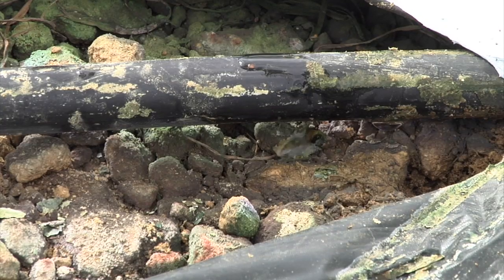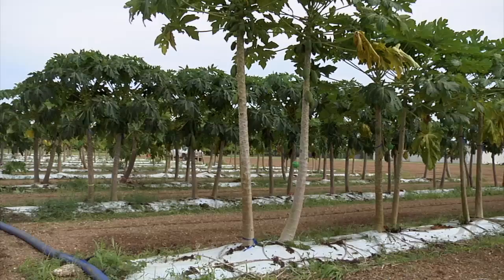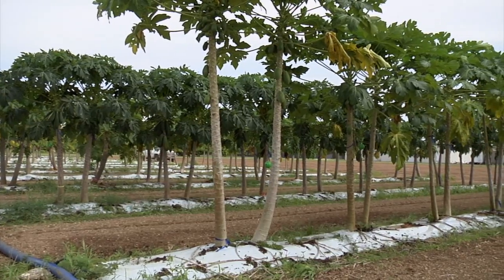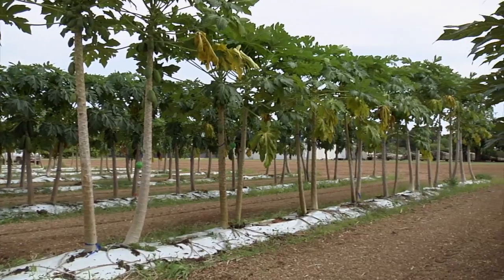It takes some time to fill drip systems when irrigation begins. The actual time of irrigation is not the time the system is on, but rather the time the system is fully pressurized to the last line of the drip tape.